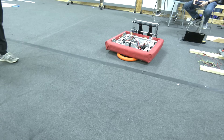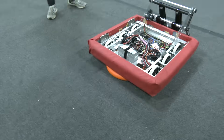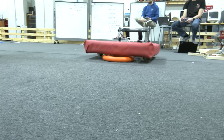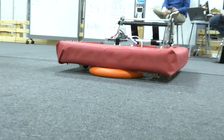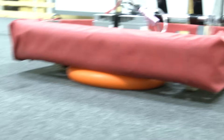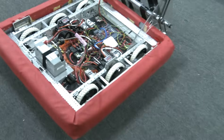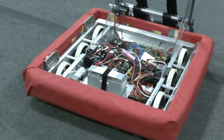So here we got the note stuck under our robot, and this is with a two-inch gap. Currently it's not riding on the bumpers — it's riding on our chassis of the AM14U4. This is going to be a standard height for all KOP chassis that are going to be running the six-inch wheels. You can see this is having a tough time. Go ahead and take it vigorously and try to get that out of there. Now that game piece has completely disappeared. And remember, this is going to be a possession of a game piece, so you won't be able to possess another game piece outside of this.